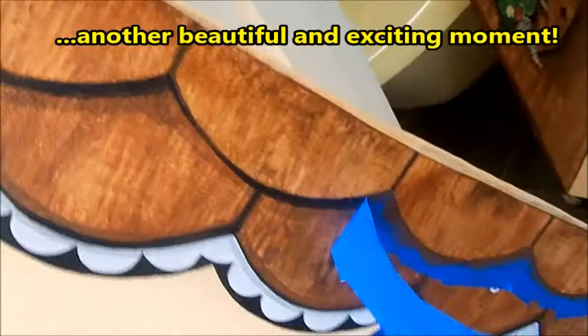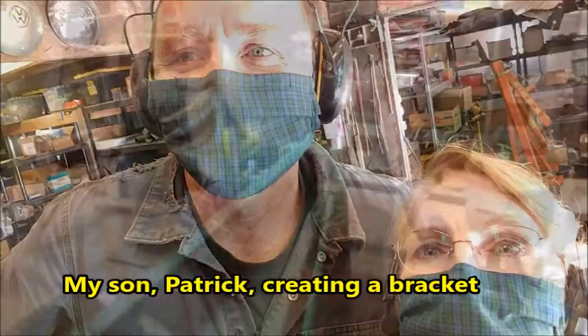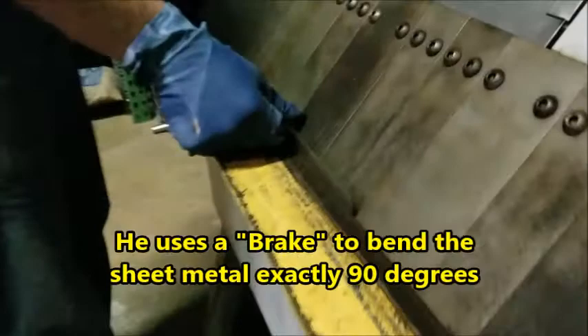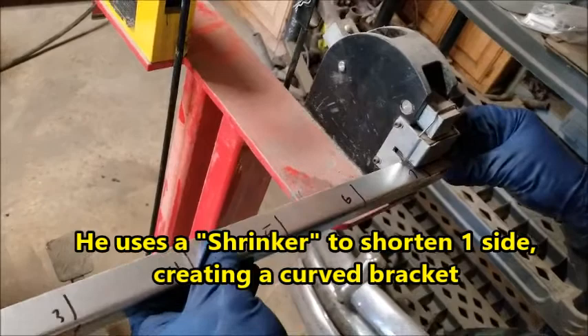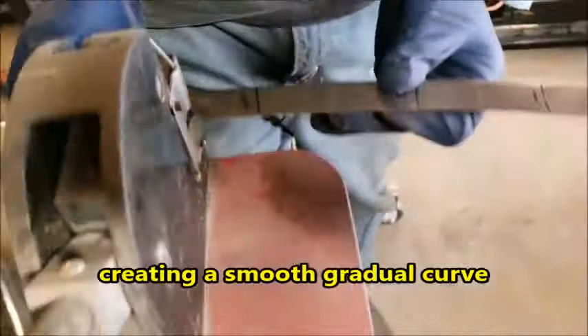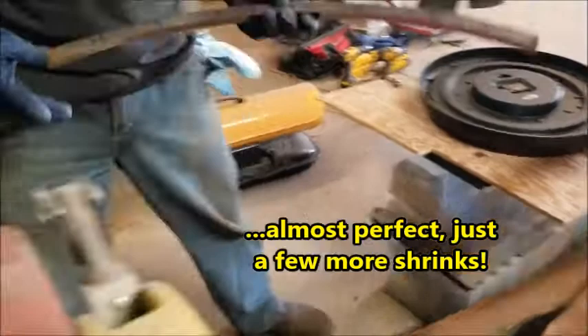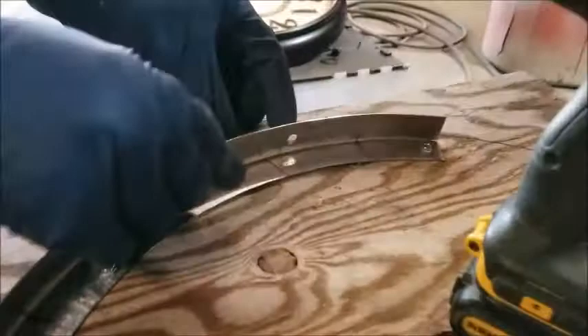Now I'm going to create a bracket for the clock - it will go here and the clock is going to be removable. My son Patrick is creating a bracket. Here he is cutting strips of sheet metal. He marks the center of the ends before he folds them lengthwise. He uses a tool called a brake to bend the sheet metal exactly 90 degrees. Next he uses a shrinker to shorten one side, creating a curved bracket. This tool crimps the metal on one side creating a smooth gradual curve. He tests it against the clock to see if it's curved enough - almost perfect, just a few more shrinks needed. When the curved pieces are just perfect, he attaches the bracket to a scrap piece of wood. He drills holes in the side of the bracket for the threaded nut rivets.